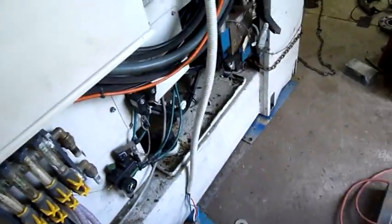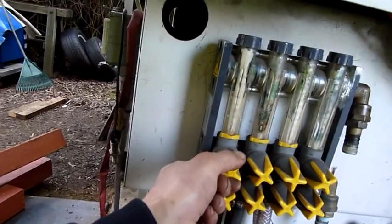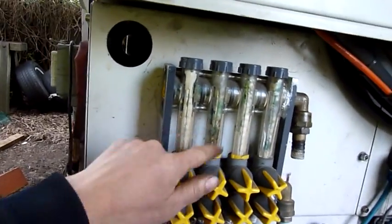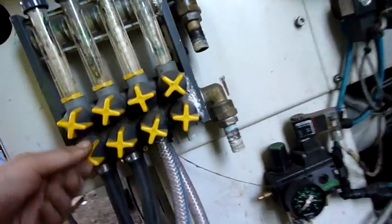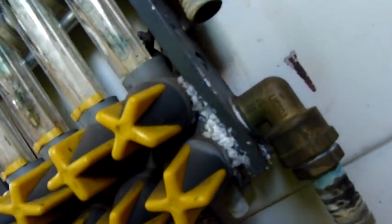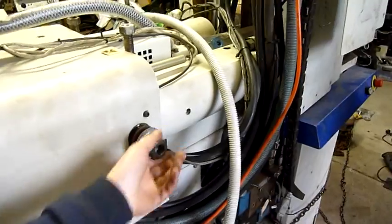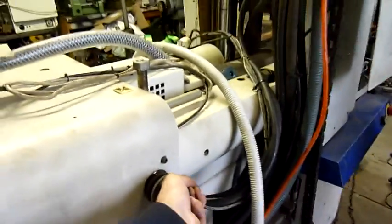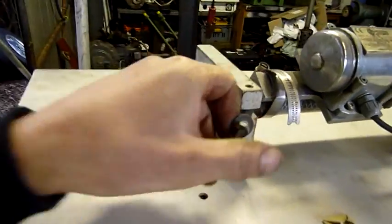Have a bit of a clean up and shuffle it in a bit further. The water flow gauges are working but need cleaning and decalcifying. I wonder if I can get the cooling tower that came with it — I'm sure they wouldn't care if that went missing, although the flow meters are all rotting out. That's what happens when you use bleach to decontaminate your unregistered cooling tower — throw a bottle of bleach in it every 12 months, that's about all they did. Shocking.